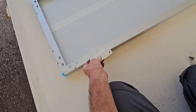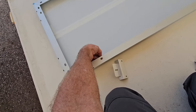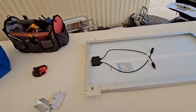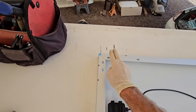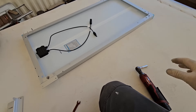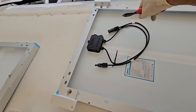You can actually see the dirt where the supports are on the roof, so you need to figure out where to aim for those and where to put the feet. Once you do, it's pretty straightforward — you've got the Z-brackets or feet right there, decide which hole you want to use, and use it on the side too. We'll just through-bolt it underneath using the washers and nuts provided. My measurements show the trusses are about 16 inches on center, so I'm going to put a foot here and a foot there on all the panels lengthwise across the front.